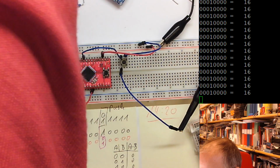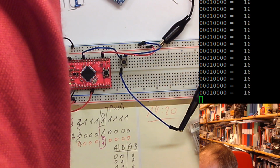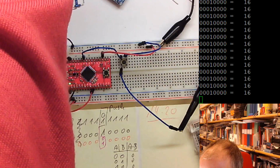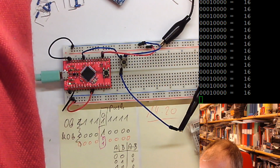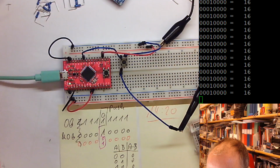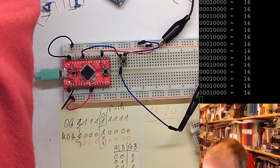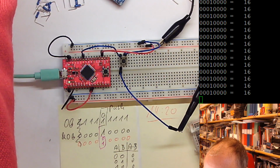No trace. Trigger, edge type, slope, yes. Not triggering. Trigger mode auto, at least first. So, yes. Okay, 5 volts per centimeter, 2 volts per centimeter. Okay, looks nice. Don't need the green channel, get rid of it. This one more volt up. Okay.